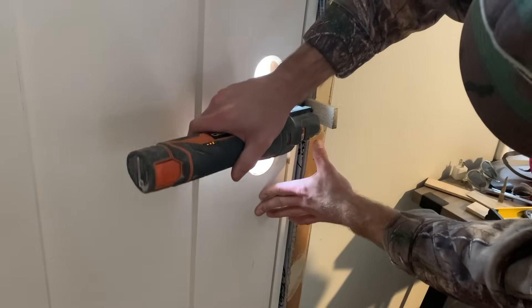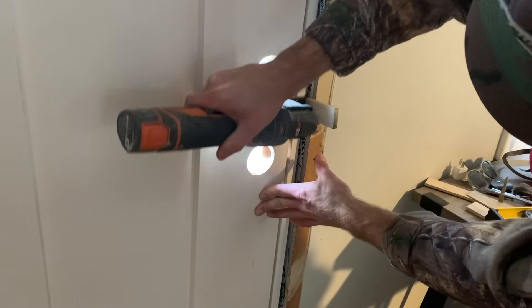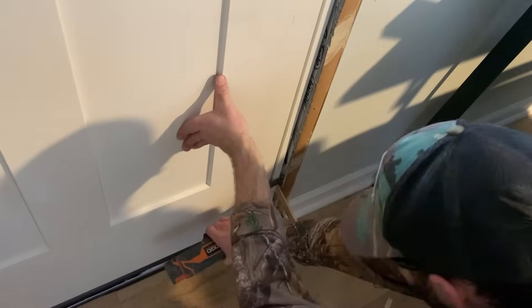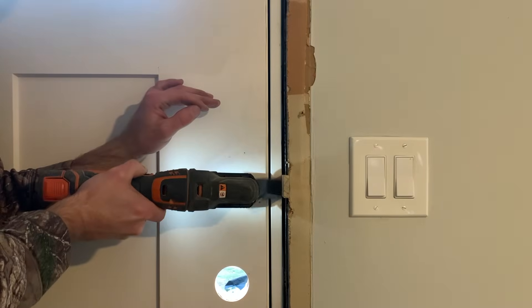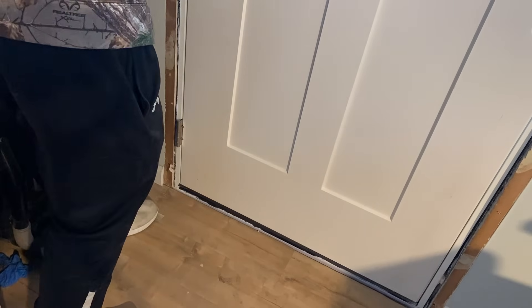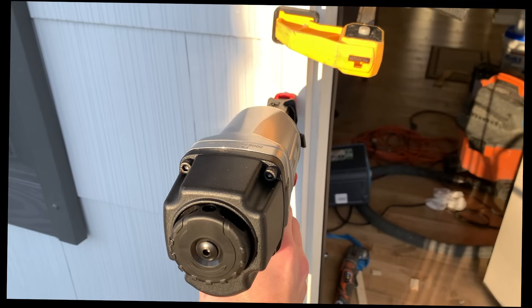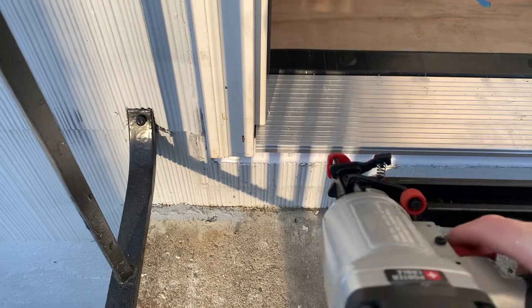At this stage, you can use either a utility knife or an oscillating tool to cut off any excess shims so they're not impacting your casing installation later. Do this for all shims around the entire door — if you have multiple shims, an oscillating tool is going to be way easier than a utility knife. And if you have an air compressor and a brad nailer, some people will install a few brad nails into the brick mold to fully secure it to your home. Use exterior-rated brad nails.